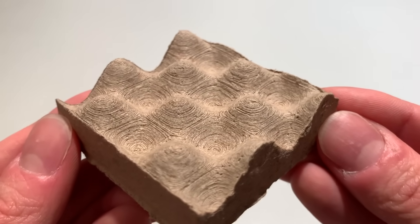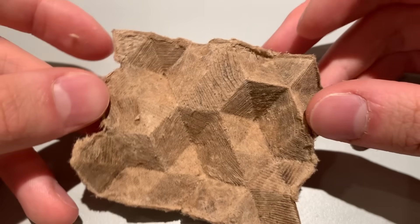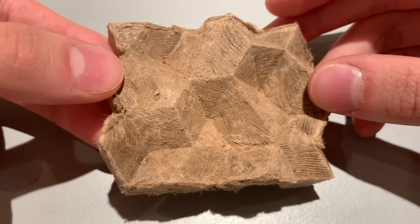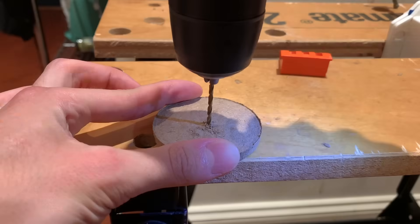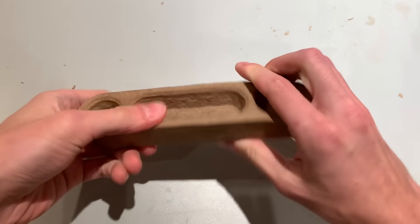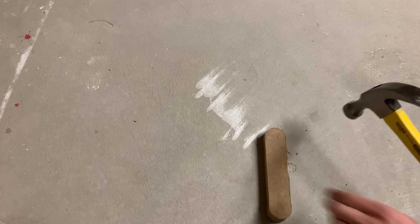The final material is very unique. It has an almost marbled look, and the layer lines of the 3D print actually transfer to the surface of the part. It's extremely rigid and tough and feels like something between plastic and a very light wood — which makes sense given that wood is cellulose held together by a binder material, which is exactly what we made here. Just like wood, the material can be sanded easily with high-grit sandpaper and can even be drilled fairly cleanly. The parts are pretty strong and definitely can't be broken by hand.